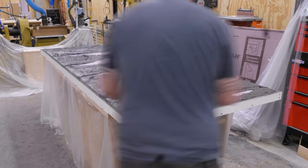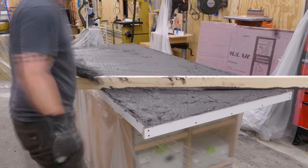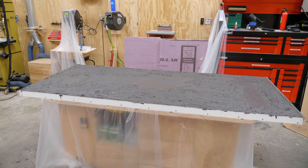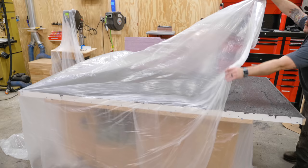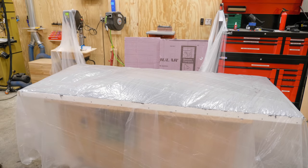Once those pieces were in place, I mixed up the final batches of GFRC, aiming to make them a little thinner so they'd flow out more easily. Unfortunately the concrete was still fairly thick, and I was having a lot of trouble getting it under those wooden pieces, so I kind of furiously pulled off the wooden pieces and filled up the rest of the form. At this point I realized I didn't have a good way to smooth the back surface since I don't have any trowels big enough, so I tried screeding — something I knew was kind of a no-no with GFRC — and that really only made things worse. So I threw a piece of plastic over the piece and called it a day.